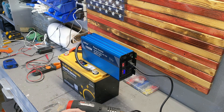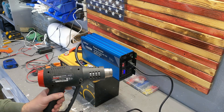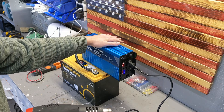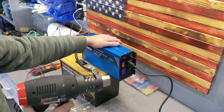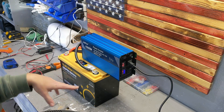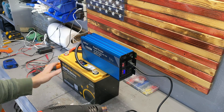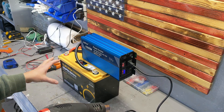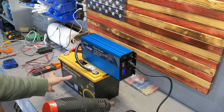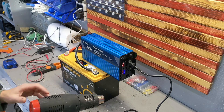It's super safe — it's not going to overheat, not going to burn, not going to do crazy things. That was just a short load. The BMS is rated 100 amps and I pulled 111 amps out of it with the heat gun. It maintained that for a couple of seconds before it turned off, then came back on. These lithium iron phosphate batteries are super safe, the BMSs are super smart, the cells are very durable — no gases, nothing creating problems inside a van.